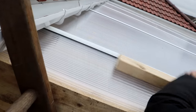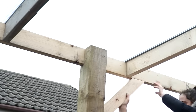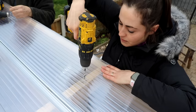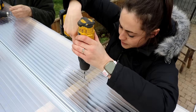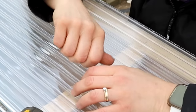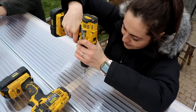To make sure the carport was structurally sound, we were asked to fit some gallow brackets — structural timbers cut with a 45 degree angle, then pre-drilled and screwed to the wooden post and the beam above. We also pre-drilled some holes in some of the battens to screw the polycarbonate sheets down, attaching them with a plastic fitting that has a cap to cover the screw. I'll find links and leave them below, but they may actually come with the kit anyway.